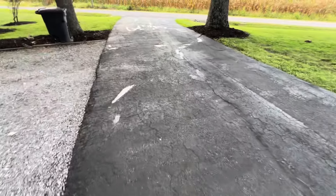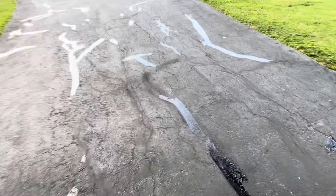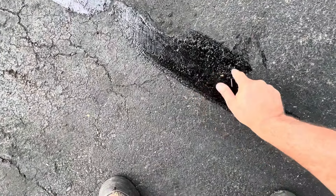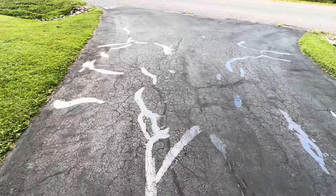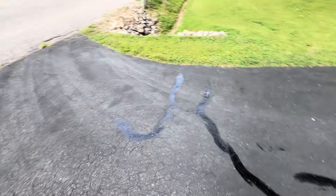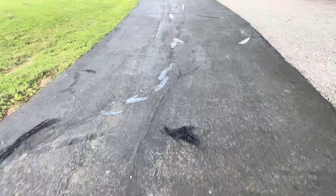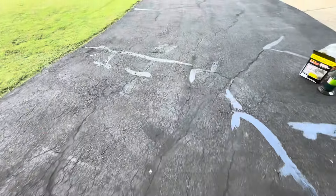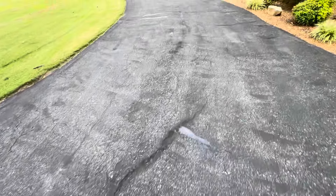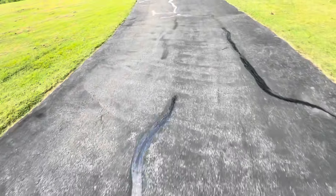I'm going to take you on a little tour so you can see everything I did. It'll stay a little tacky but it won't stick to your finger — that's a good thing because we're getting ready to put the driveway sealer on top. It's filled in all the bigger cracks that your normal sealer would not seal. I've tried the stuff in the gallon jugs from Lowe's, Menards, or Tractor Supply — it looks like it would fill a nice crack, but it doesn't. Once it dries, there's nothing left; most of it seeps right down through the crack.